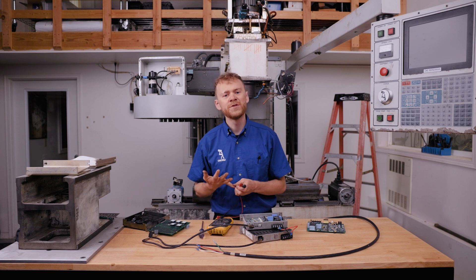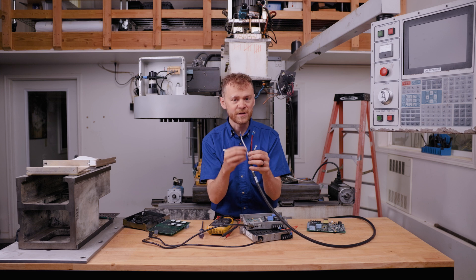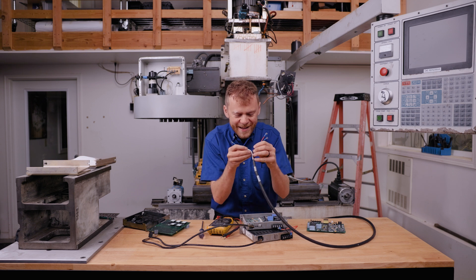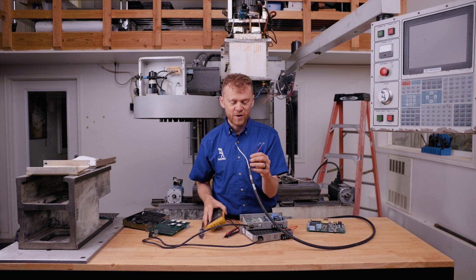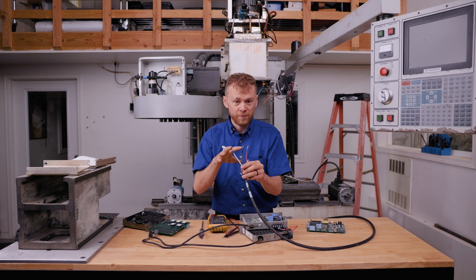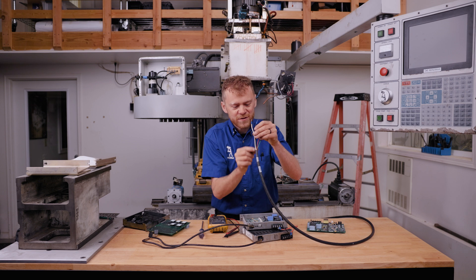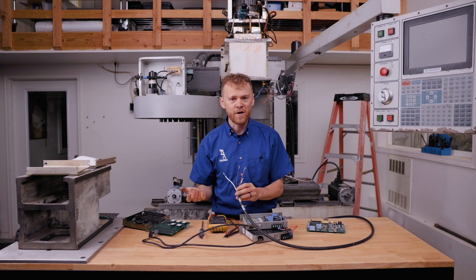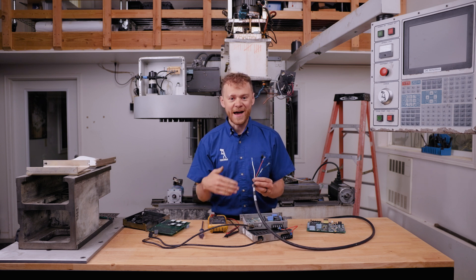It will tell you if you have coolant in your motor or a cable fault. Years of this cable dragging — what happens is the insulation wears through with the oil and coolant. And now you have what they call a high voltage short, kind of like the wires touching each other. But you won't notice it with a regular ohm meter. You have to have a mega ohm high-pot tester — a few different names for them. It'll put out 300 volts; I have one that puts out 1000 volts. If these wires were really close and we put 1000 volts, it might jump between the two. That's kind of what happens with your amplifier, and then you'll get a ground fault and an alarm, maybe only when it's working really hard.